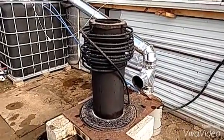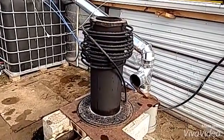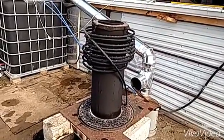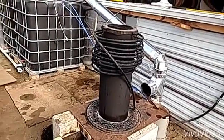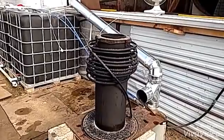Hello and welcome back. This is my rocket stove build for my aquaponics system. I want to give you an update. I've been having this rocket stove burn for about a week or so and took the barrel off here. My temperatures have averaged about 500°F with a high of almost 800°F.